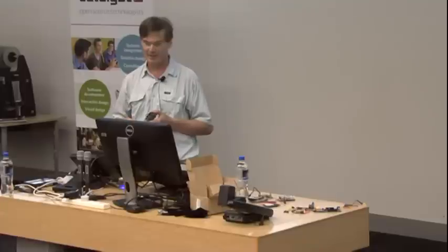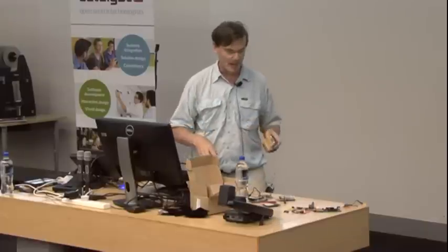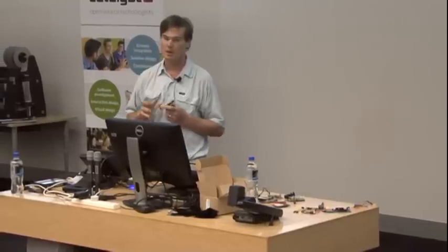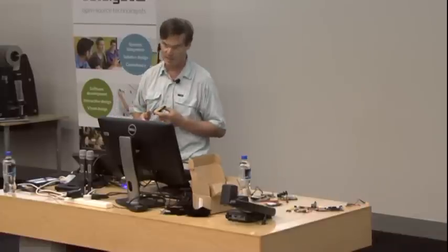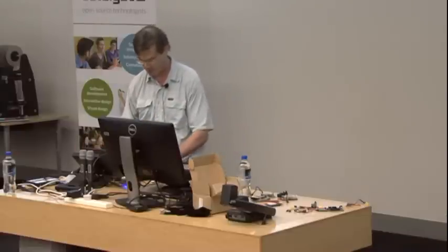So there it is, rounding that corner, and it should soon do the last leg up towards the landing. It's also doing an awful lot of I/O. It's helped by this board having a couple of programmable real-time units, and they're doing the microsecond-accurate stuff in the plane, because there are some things that need to be microsecond accurate. Most things don't need to be. You can see it's heading towards the landing path now. It might be worth popping back once it's in the final approach, so the video may make more sense and not just be a dot in the sky.